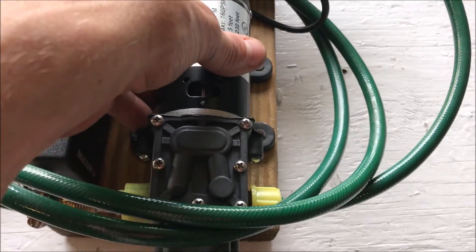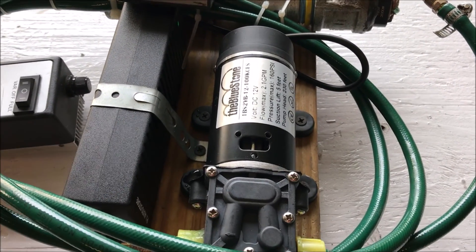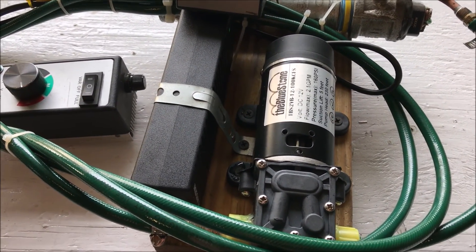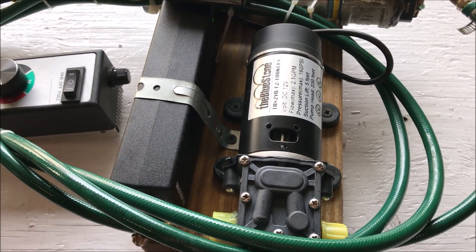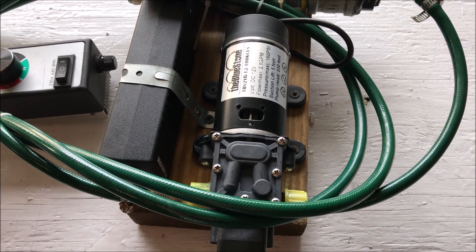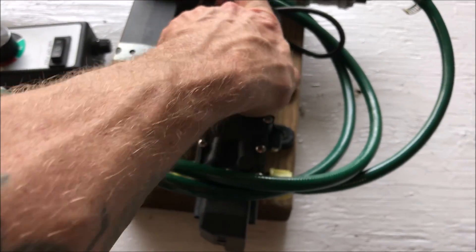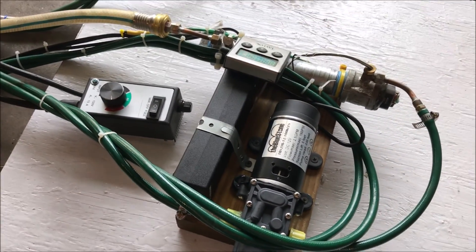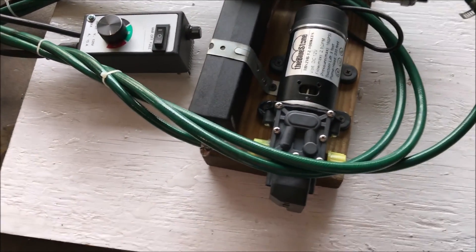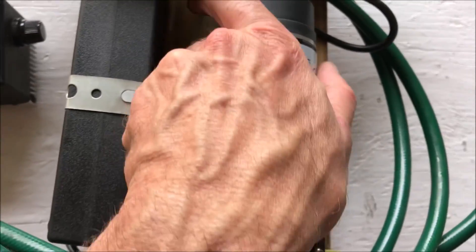This motor is cooking itself and I know why — it's constantly running on and off, never getting up to full RPM because of the load we're putting on it. It's inevitably going to die like that. It has to be able to run at a specific RPM for the cooling fan to cool everything off and we're not getting that. Things aren't as simple as you think when you've got them on paper, which is why I don't put anything on paper. I just build the thing and find out what's going to burn up, then swap it out for something that won't.